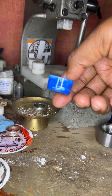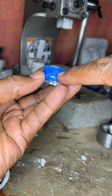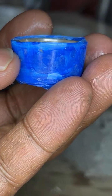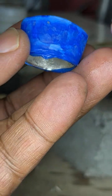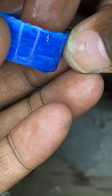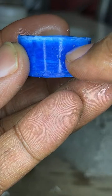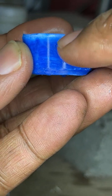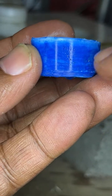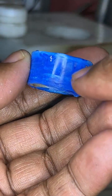Now it's very important to make sure when you're doing this that you don't destroy your coin. That's why we put the tape around it. But as you press down, pay attention to the discoloration. You see right there that the lettering starts to show. That means that silver was pressing right on that coin ring. You understand that? You see that the 2002 presses through as well. This is why we put the monster tape, to protect that detail, because we don't want that metal to metal to start to mar that detail away. So when I see this discoloration is when I want to change this tape. Okay.